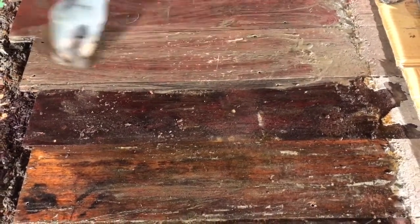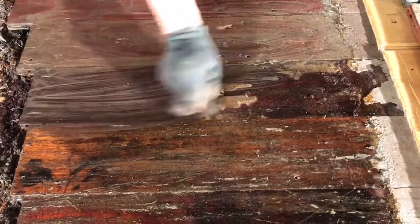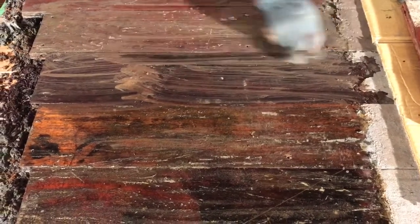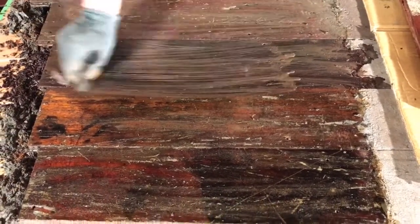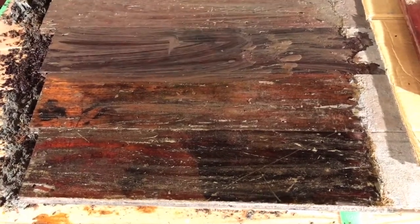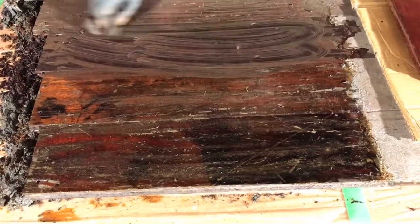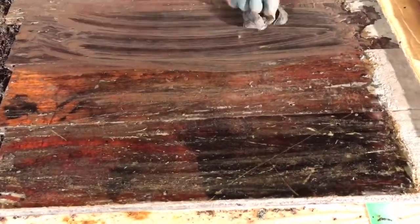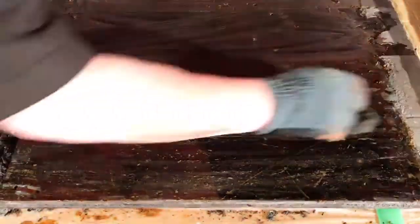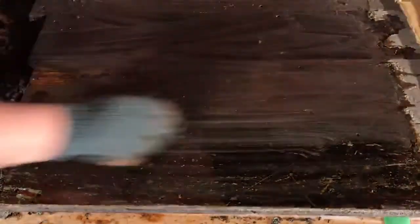Now this sort of system here too, let's say you've decided I want to make a bench or a dining table or whatever sort of table, coffee table. Well, floorboards are brilliant. I mean, I just slapped this up this morning, you cramp them up, screws and battens underneath. But this is an ideal look for that type of surface. Just when I'm finished here, you can imagine this sort of table in a cafe somewhere.